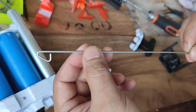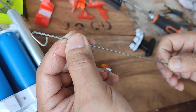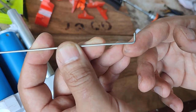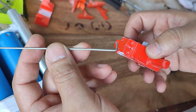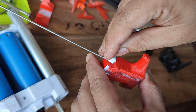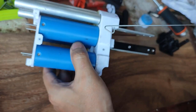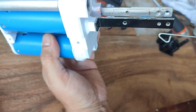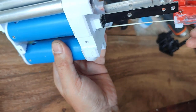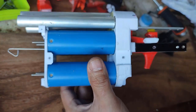The spring goes like this. Attached to the trigger is the trigger rod — this one is made from 1.5 millimeter stainless rod. You have to bend it at both ends. Then you simply attach it with what I call a trigger clamp and insert it right here at the back through the big hole at the center, and slide it in like so.